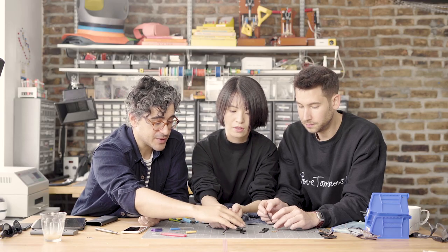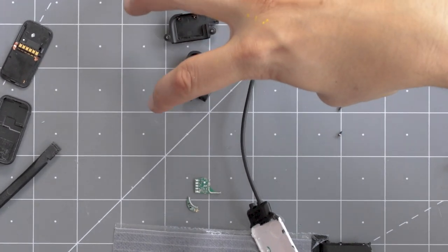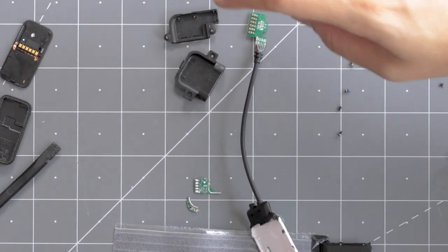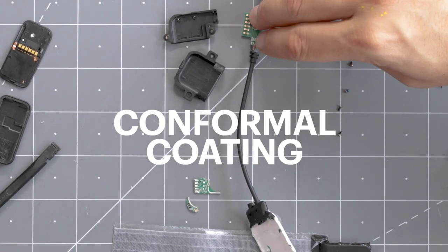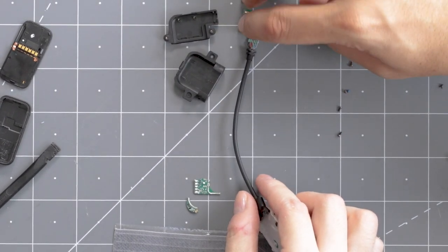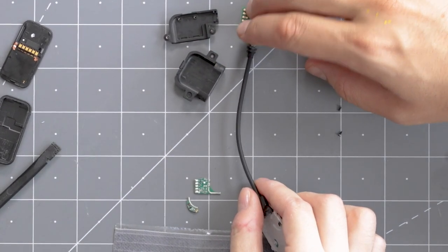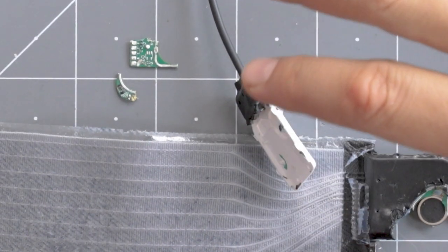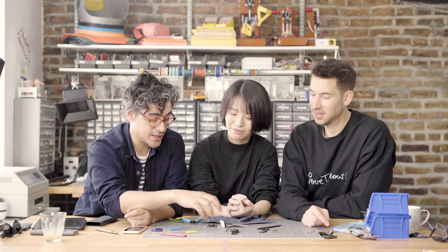Mating with that is something also well-made — this is the connector side. These are three molded pieces. There's no sealing here, so this is designed to get wet, and when it dries any shorts would be removed. There is some conformal coating over the leads where it connects, but this allows for a very robust, non-fussy connection point inside the jacket.